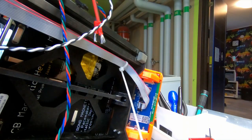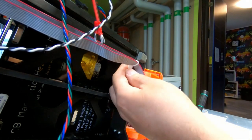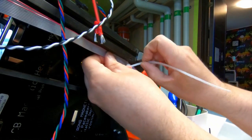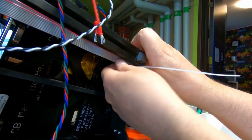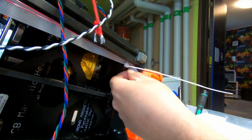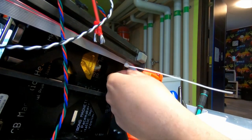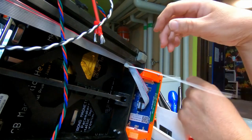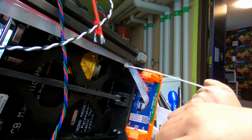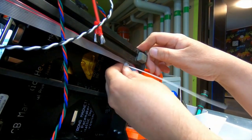Okay, this is not a Prusa invention, this one's mine. So if I put a loose zip tie around there, like that, and then my one goes to push the... I'm going to put a few more of these, and then one can just click it in there. Now what this leads to, it can't just flop out, even if the printer's shaking and doing its thing. And this zip tie does not crush the cable. So I think that's a reasonable compromise.